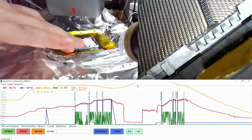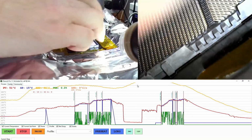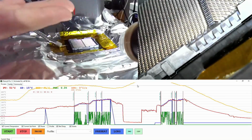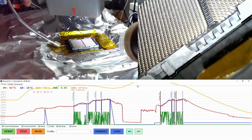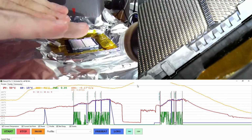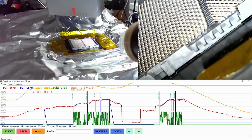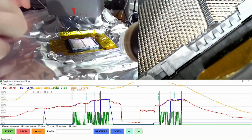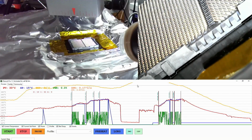Alrighty, the board's cooling down. The reason I'm suspiciously testing each corner and seeing if it flexes is because the board flexed a lot more than they usually do. So I'm not sure about this, because sockets don't flex that much. They will flex a little, especially AM5. That's why AM5 has the best success rate, and that's why the sockets with the window have this window inside. When the board flexes, it's easier to get every pin soldered on the socket that has a window inside. With AM5 we don't have that, so I don't know.